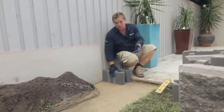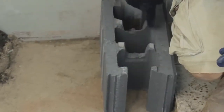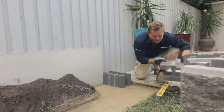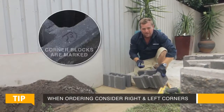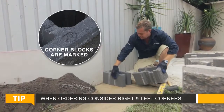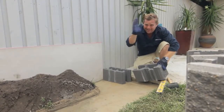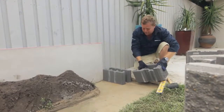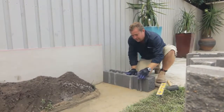The best thing about these walls is you don't have to mud up between each joint — they lock into each other because of all these lugs, and the corners are super strong. When you're ordering your wall, one thing to take into consideration are the corners. There are right and left corners. If you see the back of this one, it's completely different to just a normal block — there's a little groove for the next block to lock into. So this is a right, meaning we're turning right and going down there. At the other end we'll use a left. And on the next course, we'll use a left, so we get that bond happening. They just butt into each other — slide one into there, and then we'll set up the string line.